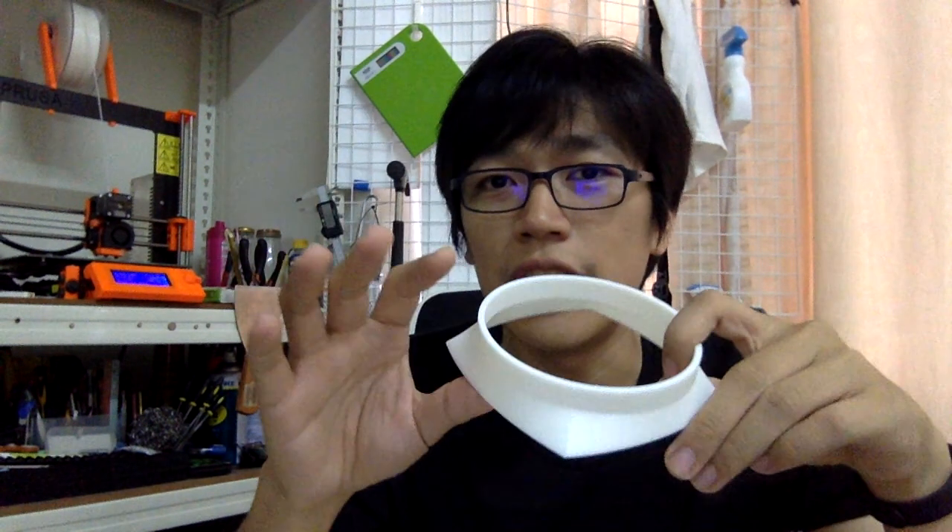If you want to leave the print on the printer and continue automatically, there's no such function — the only way that works is if you press the pause button and then resume. But in my case the printer ran overnight until the filament ran out, so you can't just repeat the print. Even with methods like changing the G-code, you still need to do the XYZ homing step, and that doesn't work for a large model like this. So the simple way is just to delete the bottom part and continue printing the top.